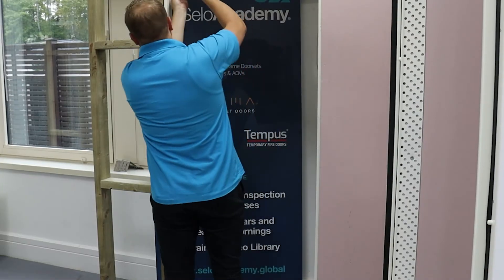If your opening is not smooth, each point of contact can be adjusted to its own unique position. They can then be tweaked all round to ensure your frame is square and plumb, and you've got perfect door gaps all the way around.